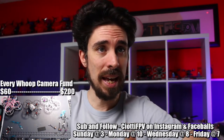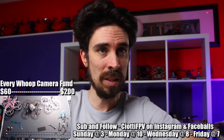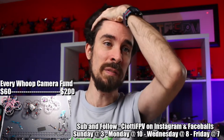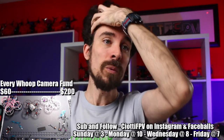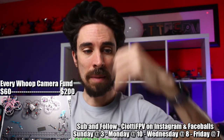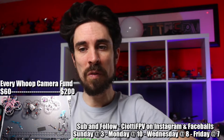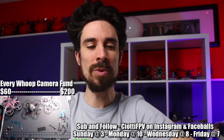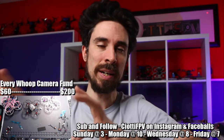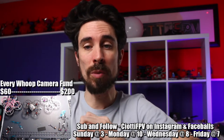Simon says, had a tiny whoop short circular polarized antenna not working, went back to linear, but loved the antenna inside the canopy. So cut the whip as short as possible, works better than OG and lighter. Fun discovery. Yeah, if you guys didn't know, you can direct solder antennas. It's not easy, but it's totally doable. I've done it on stream before. Search for direct solder UFL or direct solder antenna on YouTube and you'll find it.